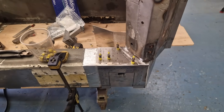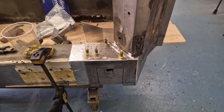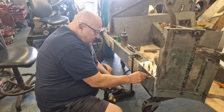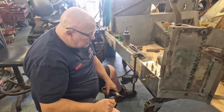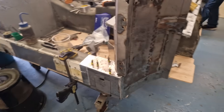I'm a little concerned that when we start putting rivets in - because we can't pull very hard with pins - when we put rivets in, this might start to move. This is where you find out if it's not quite right, because there's one thing looking at it and going 'yeah, that looks marvellous', and another thing when you actually pull it down as things start to move. This whole thing might move. I'm going to stay across the diagonals on this.